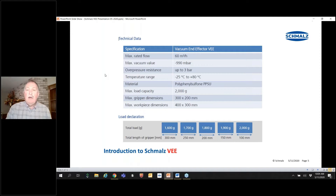60 cubic meters per hour is the maximum you can force through this particular size of tubing. You can get almost a perfect vacuum on it, but there is a blow-off resistance level you cannot exceed — three bar — or you'll actually push the unit apart. You don't want to hit and then apply blow-off without sufficient leakage underneath, as you can disable the unit. It has a very wide temperature range and handles very cold, making it suitable for food applications inside freezers.